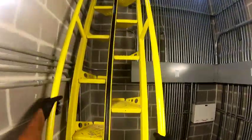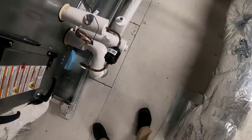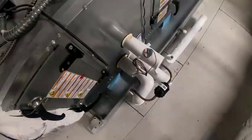Like I say, I've been to this site one time just to diagnose that unit. I think I changed the blower motor out here too though. So I just don't remember if they had solenoids or not. No, they don't. See, all of them had these little filter dryers. They so small, it might not hurt nothing, but I guess the contractor did that for a reason. But I'm gonna either scrape pipe it out there and put me a filter dryer, but I'm gonna take that filter. I got one filter dryer. So the one that I'm doing, I'm gonna take, because I'm not gonna replace both of them.